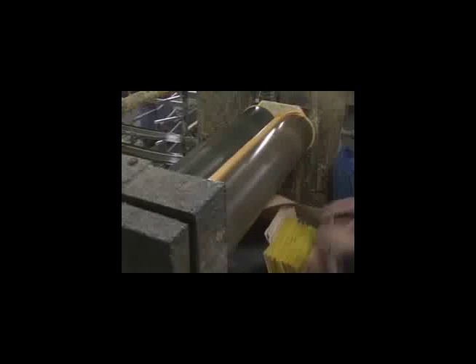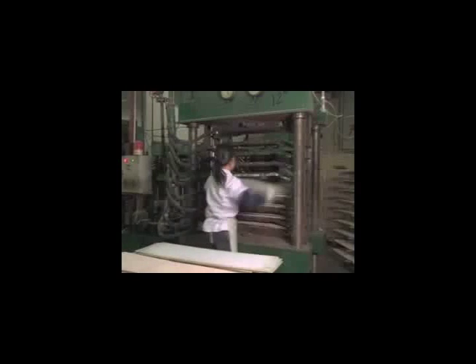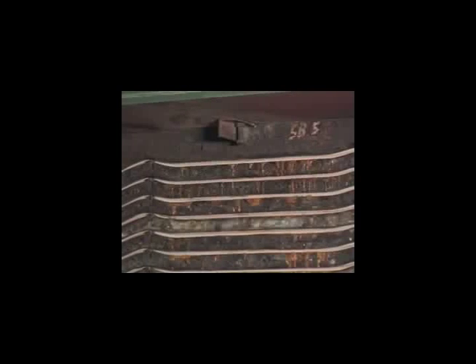The next step is to glue and press these veneers into their intended mold. The quality of the glues and their catalyst is a huge factor, especially from batch to batch. Each mold was CNC'd out of steel, ensuring that each and every mold was identical and would never decay over time, in contrast to the standard way of making molds individually with less permanent material.